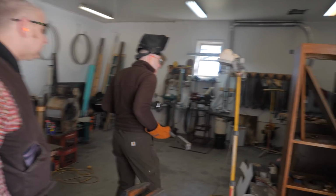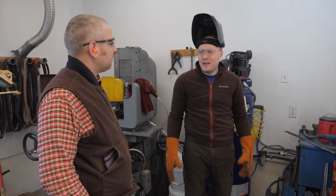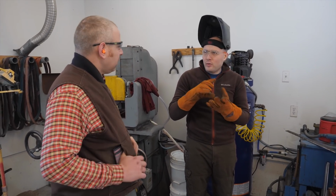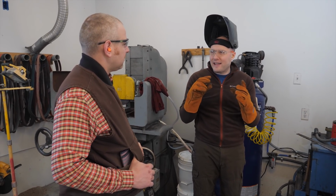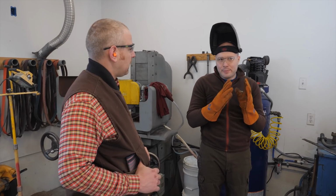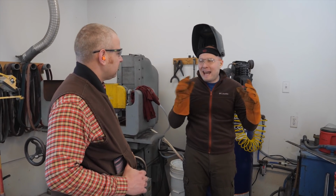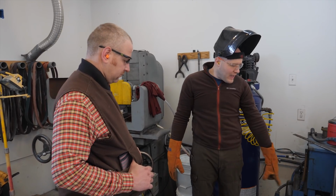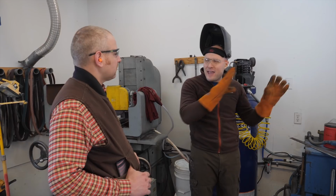I'm gonna take it over here and put it in some diesel fuel, it is kind of low. This kind of acts as a borax in a way, because that layer of diesel will burn off inside your billet and create a micro thin layer of carbon, and it actually can protect the billet a little bit from atmosphere. You definitely can't take your billet in and out of the forge when you do that, but I do that for that reason, and it makes it easy for me to sprinkle some borax on before I even put my billet in.